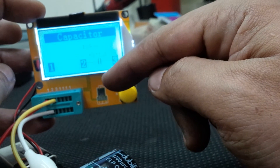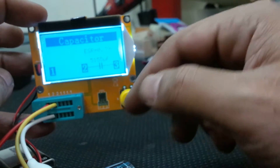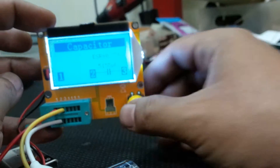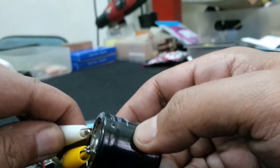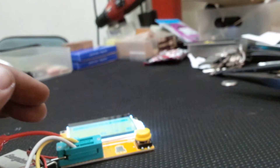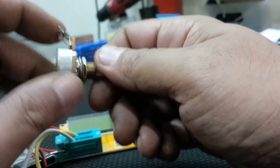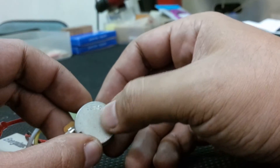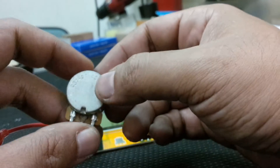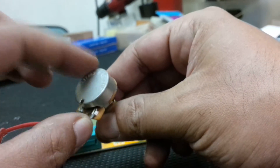The display was showing a voltage loss and then it suddenly disappeared. I'm not going to worry about that since I'm not using this capacitor anymore. Because I repair guitars, let's check some guitar parts. This volume pot has a code that I could look up online to find the value, but we'll use this tester to do the job for us.